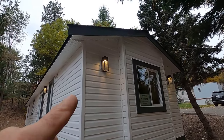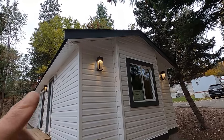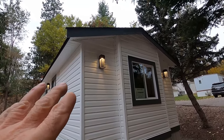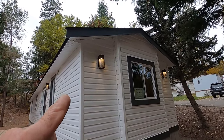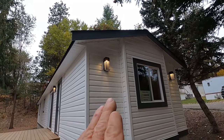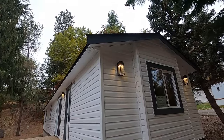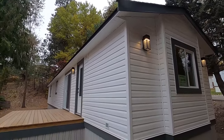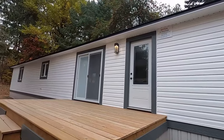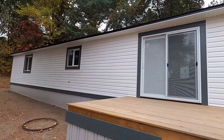What's important with these LED lights is the color. The higher the number, the bluer and whiter the light is. You can see this is a nice warm glow — these are 3,200K. If you go to like 5,000 or 6,000K, then you start to get that really intense white-blue light. So 3,200K is the color temperature I like to use. This was a big job — it was a big puzzle with a lot of pieces to put together here.